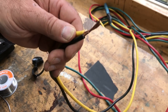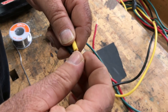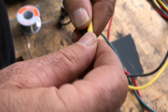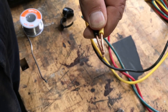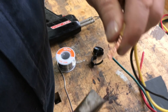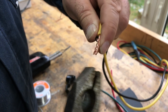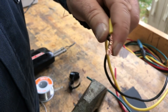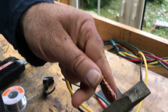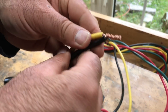The first step with something like this is to twist the wires together. If this were more finely braided wire I'd be able to twist it by hand, but it's a little too coarse for that so I'm just going to use some pliers. Before you solder you want the joint to be physically connected — twisting is a great way to make that happen. I'll twist it here and cut off the frazzled end, and I'm ready to go.